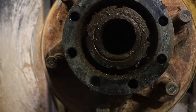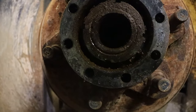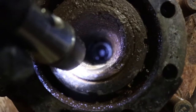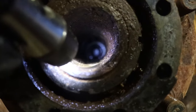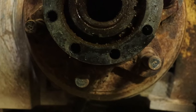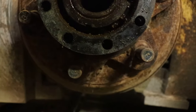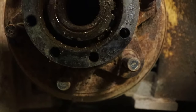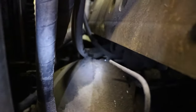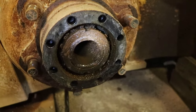There ended up being oil in the other bearing. The bearings will be a low point in the system on each end. The oil level just kind of covers the bottom of the inside bearings for the differential. So I'm thinking if we're lucky, the water will just be in the bottom of the pumpkin, because water sinks to the bottom — it's heavier than oil, and oil always goes to the top. There's just a plastic seal at the top of the diff there, and that would be the culprit as to why there's water in this thing. It was outside for the most part, so I'm not sure how long this was going on — but they probably used it in the rain.